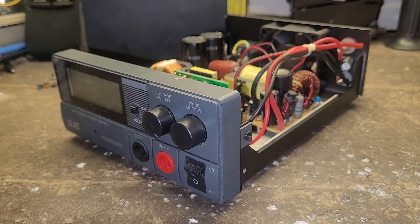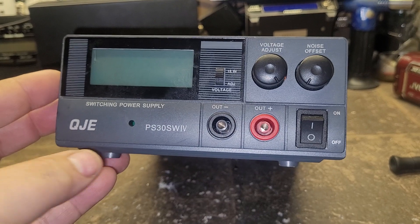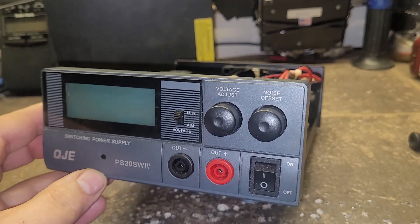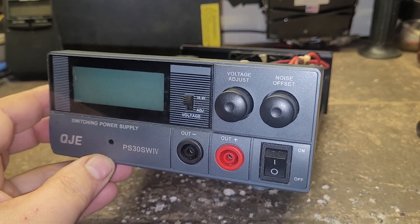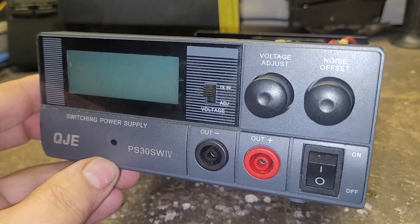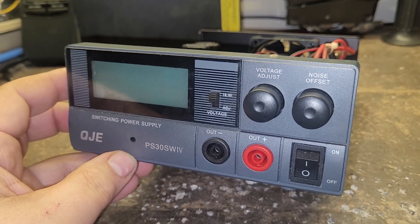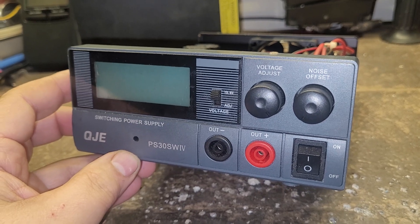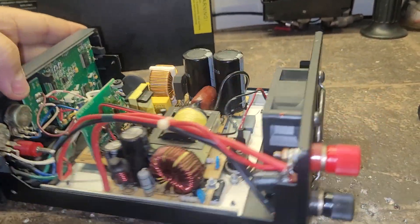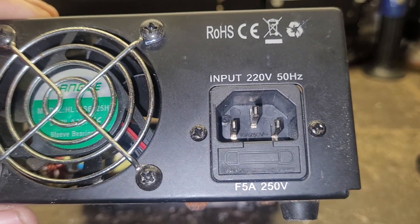For others out there who might have the same supply here in North America wondering why theirs are probably acting kind of weird — a viewer on my channel, Tom Stowell, commented on my video saying that the trick to these power supplies is they need 220 volts to operate. I was using it on 110. It's got the regular power cord, three-pin plug, ground — threw 110 on it and it should work, right? Nope. This is a power supply that runs on 220 volts, 50 hertz.